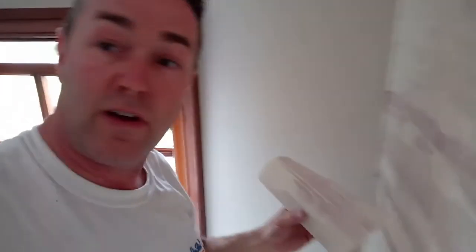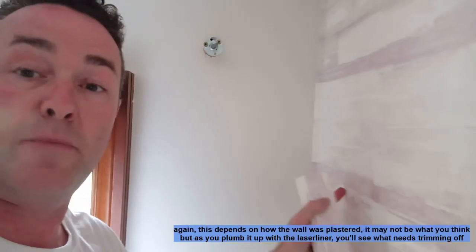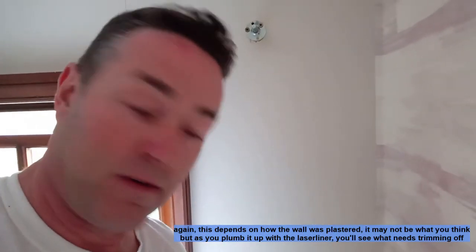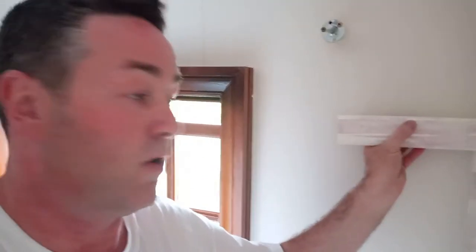But as you go down, you'll find it'll be mirrored or opposite. So we'll be fine up at the top, we won't need to cut anything off. By the time we get to the bottom there'll be an overlap onto that wall of about an extra half an inch. So as long as that left hand side out there is plumb, and you get your laser liner matching your pattern round - take that pink line all the way around and it comes here - as long as that's matching and that is plumb, you'll just be trimming off a little bit of paper on the bottom. This is where we come into bad plastering - or rather, someone's not really thought about getting a straight true angle. This is what the decorator's coming up against - we've got angles running out - but you've got to know how to get round it.